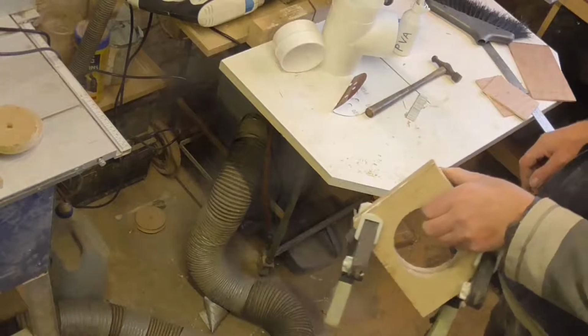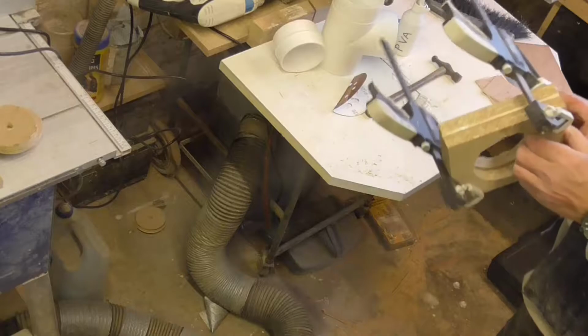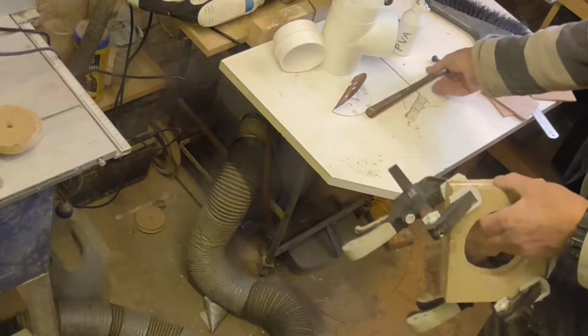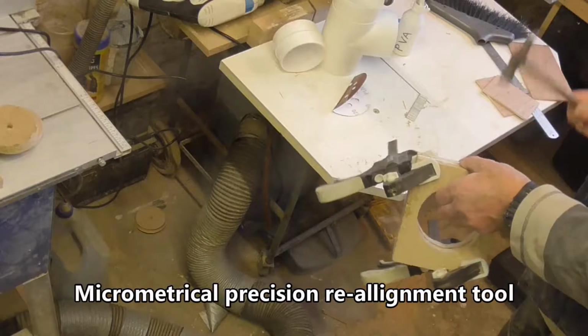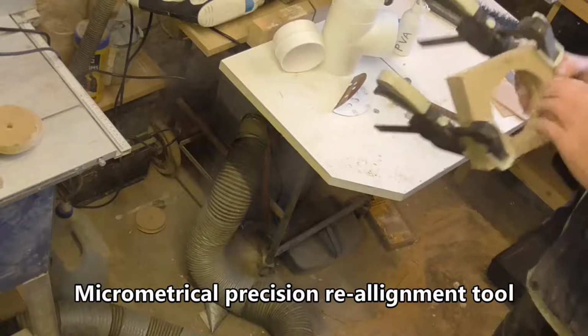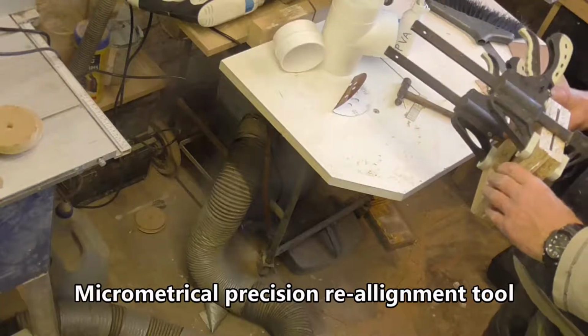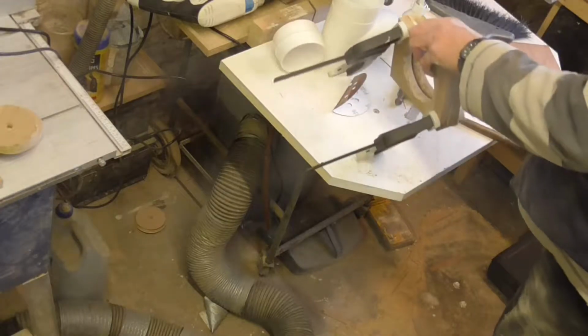Two sections of the plates are just put together, so we've got a nice 6mm gap in between with three sides that are closed, and the gate itself was cut to fit snugly between the sliders, minimising air leak or air induction in the system.